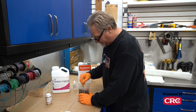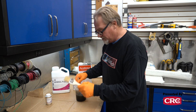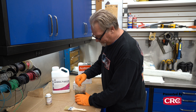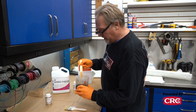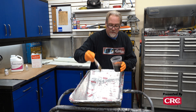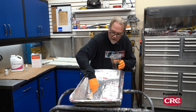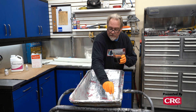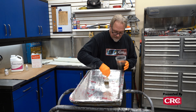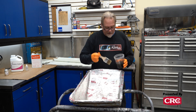So you mix this stuff up good. You can also use the brush to stir it, but with this big a container the brush would go too deep. We're going to basically just brush some of this in. I like putting a layer down first because it sinks into the cloth quicker, and it also keeps the cloth from moving around, which is annoying when you're trying to position it. Of course, sometimes you want the cloth to move around if you don't position it right the first time.